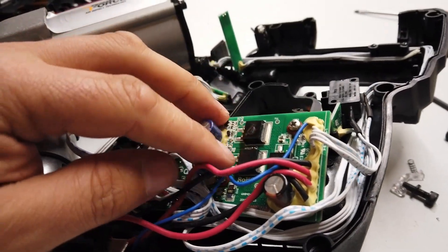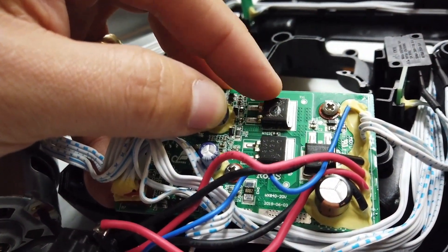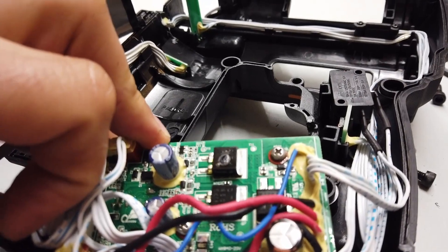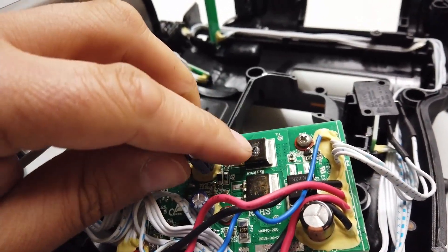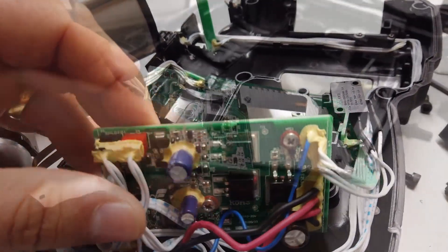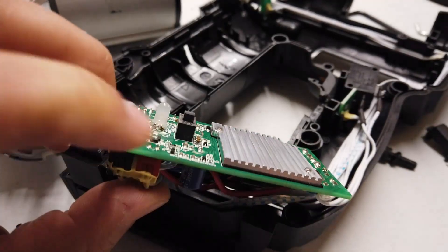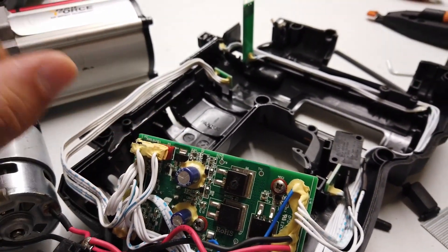There's some complicated circuitry in here. I've immediately found out where the smoke has come from. If you look at this device here, it looks like a FET. If you look at the front of it, you can see a massive great big hole in it where the magic smoke has escaped from the machine. So it looks as though we're going to have to buy a replacement. The other thing I'm also very nervous about is on the back of this board here, there are a lot of small components. And normally, when you get those kinds of currents going through something, you end up with a faulty PCB in multiple places, not just one. This unit may be completely cream-crackered.